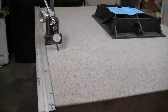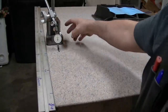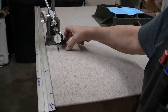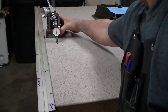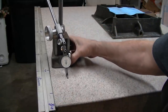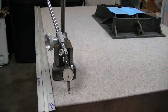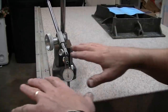But if you look at this, this is zeroed. This is basically acting as a repeatometer. It's got 2 feet, well, 3 feet, and then this is 3.5 spacing, so this is 3.5 inches out further, with a silicon nitride ball. So right here, this is running along. Okay, it's generally zero. Now watch what happens when I get to the zone where I'm measuring here. That's dropped 2/10 right there. And that's because of me getting the center of gravity of the plate over here.